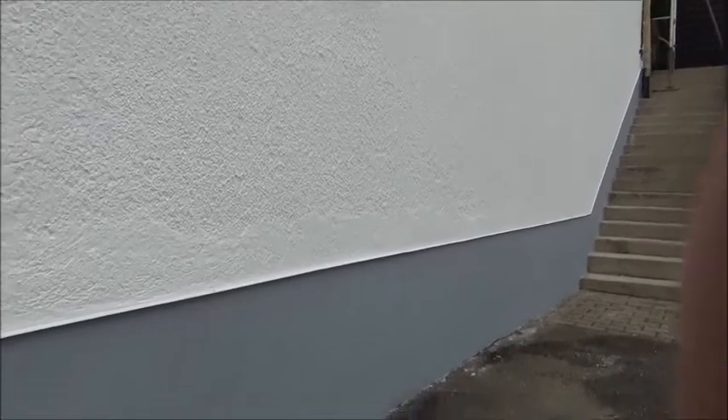Above you can also see the plaster repair, which is also completely okay when you look at it like this. When repairing a different plaster surface on old established plaster, it's always visible, but here it is absolutely minimal and completely acceptable. We have worked in a nice drip edge — it can rain and the water can run off exactly here, drip off, and so it no longer runs down below as a constant, permanent wet area.